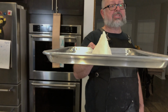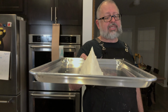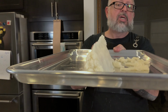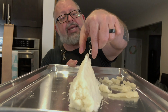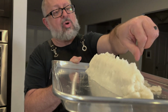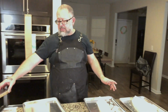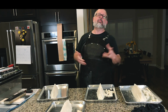That's going to give you great edge retention and a good cutting feel. You want to do all this to make sure that if you end up with teeth, the problem with teeth, and people love a toothy edge, toothy edges tend to cut really well in fatty food. The problem is that the teeth break off, and it causes a weakness on the edge of the knife. You might have a certain sharpness at the very beginning, but you'll find that the knife gets very dull very fast. So if you want the toothy edge, get the toothy edge, but just understand why you ended up getting a little bit duller faster.